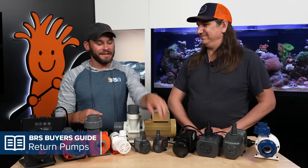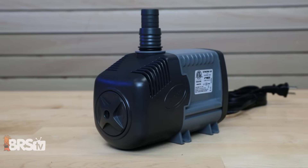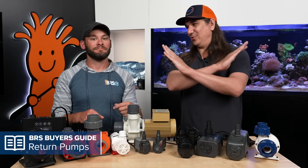The next piece of reliability is AC versus DC. AC pumps can last years and years — there's a good chance a CJ pump will outlast the tank, especially if you clean it. The AC motor has tolerances that operate in a wider range and don't require the same level of attention. It's decades-old technology that just works. The frustration is that reliability and quiet are at a crossroads, because AC pumps do make electrical noise. But if your only goal is reliability, AC is the way to go.